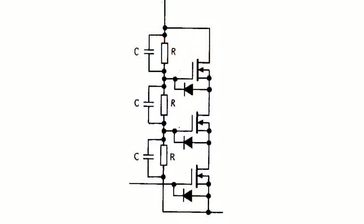Note that bias resistors yield some output current even if transistors are switched off. Therefore, ensure a minimum ground load to prevent the output voltage from increasing higher than the stabilized level. In many cases, you should connect small capacitors in parallel to divider resistors to ensure high divider performance at high frequency.